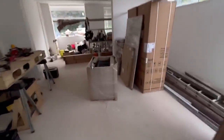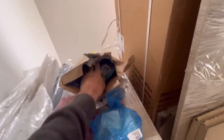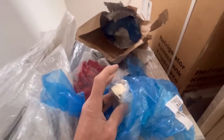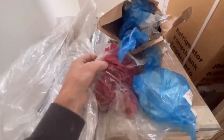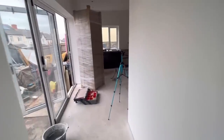So we're just going to get the waste in here and then push this cupboard into place, then the corner goes in there and returns against the stool - that'll be quite nice. Next time you see footage from me, all of this will be installed and I'll be starting to cut and measure these metal trims. There are end caps and things as well - when you cut them, these fix onto the ends. That's the corner one, and that trim goes on the end to form a corner. Then you've got these red clips that clip the track to the cupboard - you clip it into the back of the track and then screw it into the side of your carcass.